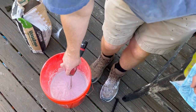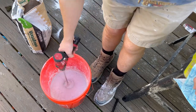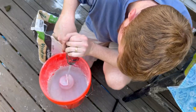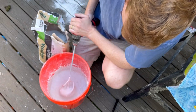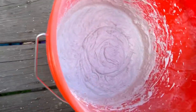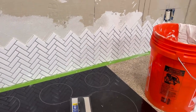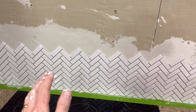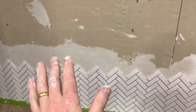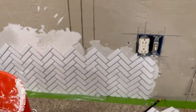Right there — that's where you want to start because it's a little soupy still. You don't want to go too heavy in the beginning because then you've got to add more water and it might turn into a vicious cycle. That feels perfect right now — that's the consistency I'm looking for. Time to start tiling. Here's where I'm at getting the first row started. I forgot to film it because I was so focused on making sure everything was working out. I've got to make some cuts — this mortar dries quick, especially when you get it on the wall.